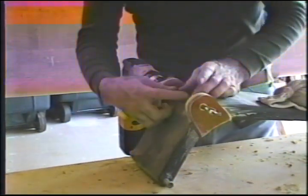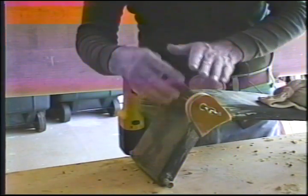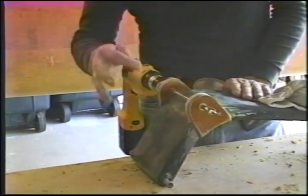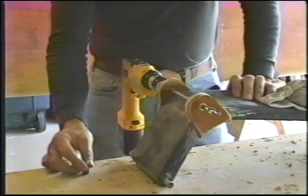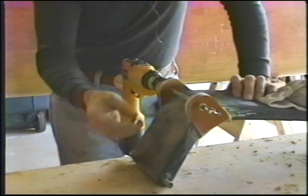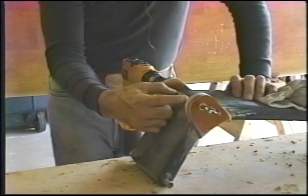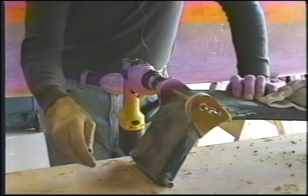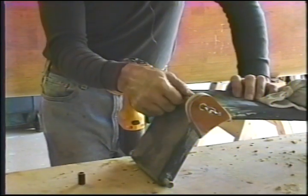We used to put that bushing in first, bond it in, put the carbon on it, and then do all the back drilling operations, thinking, oh, how slick we were with having this extra long drill guide bushing to make sure that everything was straight. But in doing so, we also had a whole bunch more surface contact area between the shaft and the bushing itself, and it just begged for galling.